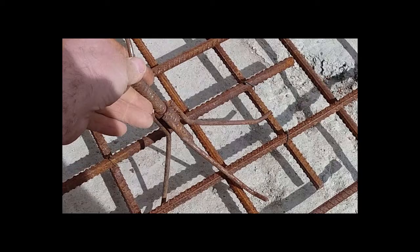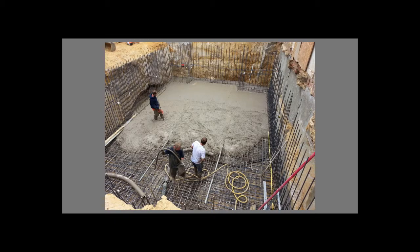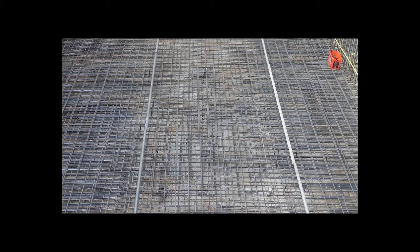And you get the concrete finished before you take the scaffold tubes out, because someone must walk through the finished concrete to the far end to cut the tying wire, and then walk back through the finished concrete again to carry the scaffold tube out, which by this time has got both ends filled with concrete, so they risk a back injury. These are quite serious issues. Going over the concrete again and again and expecting a man to lift 35 kilograms as he struggles through concrete, standing on reinforcing steel, full of holes, waiting to trip him up.